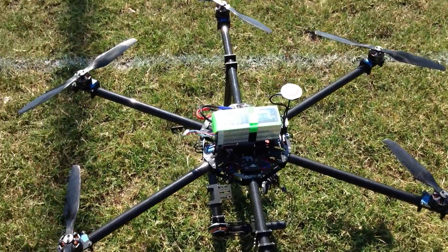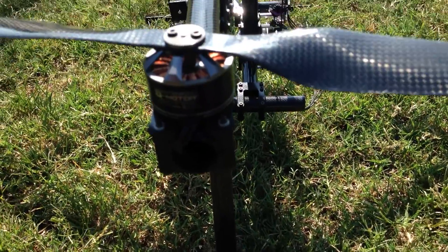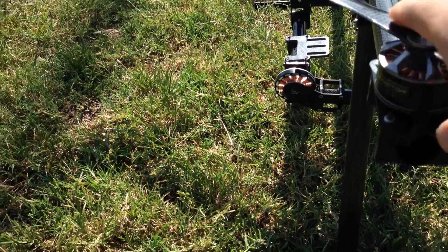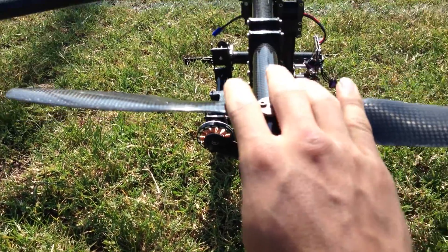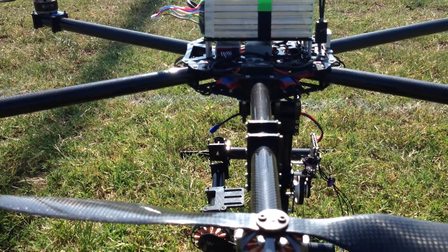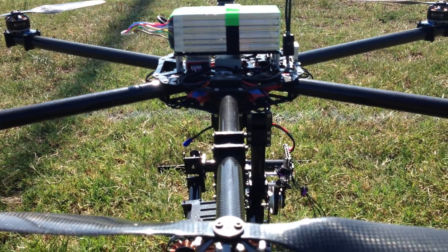You can see there's six motors here. I'm running the T-Motors — the 4014 330KV — and I'm getting pretty good performance out of them. They don't overheat. The most I've tried in this airframe has been close to 10 pounds, and it lifted up no problem.